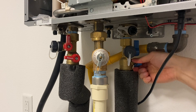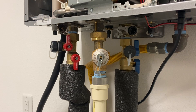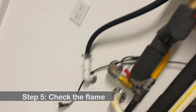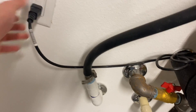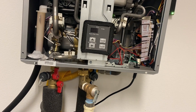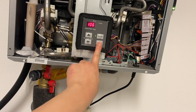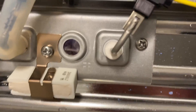Open back the blue and red main valves — now the heater is connected back to the house water. Step 5: Check the flame. Turn the water heater back on. You may see the flame through the peephole. It should be blue when it's working properly. If the color is not blue, call your plumber to troubleshoot.